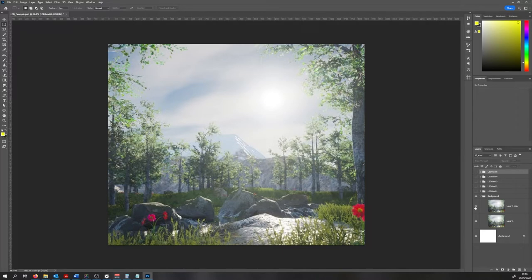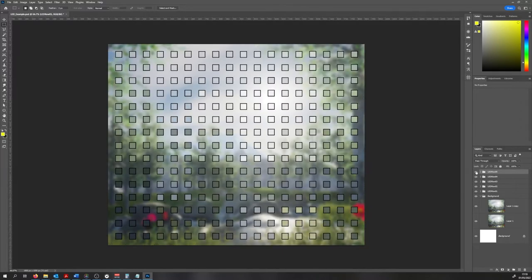How can we make the lights work organically based around the environment that the actor is located in? One of the problems that I can see in virtual production is you'll need to customize or replicate the lighting inside of the environment with physical lights and the position, the scale, the intensity, the color, all these different properties that are required to match the foreground and the background. If we could create the same LED panel on a cheap, small scale budget, and it was dynamic based on the environment, we're good to go. So my objective was to create an array of averaged lights or color swatches of what we would see in the camera. Even in this shot here, the top left would be whatever average color that is, and then the next one, then the next one. So this would be a darker color, that would be a darker color, etc.